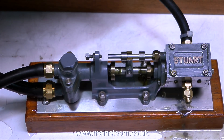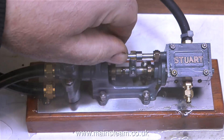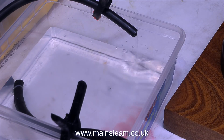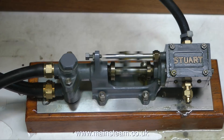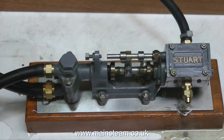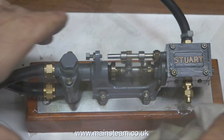This should get better with a little bit of running. I've not adjusted this pump at all - this is just the way I received it. And because it's tight, the main piston is not traveling the full distance yet, but it will do after a while. As I move the piston manually, I can feel that it's quite tight at one end of the stroke. But the good news is the pump is pumping water, so it's doing what it's supposed to do. After a while, the piston rod starts to travel the full distance. This pump, like most of these small Stuart pumps, is very sensitive to adjustment, and the problem is the gland is a little bit tight at the steam cylinder end. The water cylinder is perfect - it's pumping water beautifully.